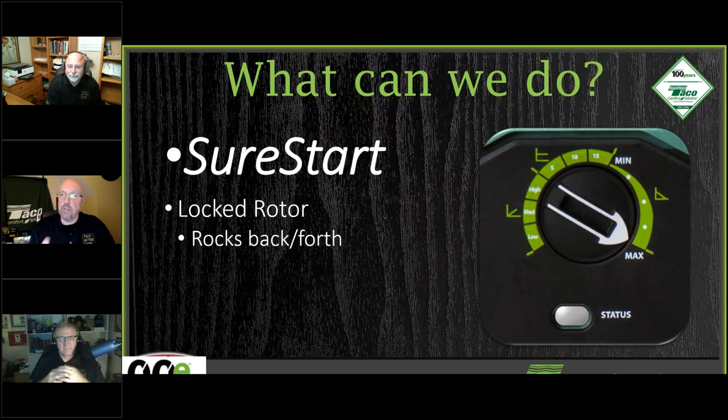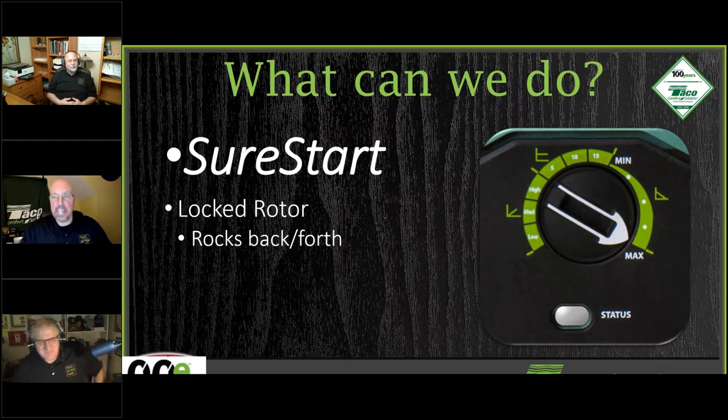What's the next thing you do, people? It's not in the instructions, but I know what you do and I want you to do it. If you know you've got a seized circulator not pumping water and calling for heat, what's the one thing I want you to do? That's right, Brian. You whack it. Whatever tool you have in your hand, a flashlight, a screwdriver, a wrench, channel locks, you give it a couple of hits to get it going. A rubber mallet, you're being nice, Ted. How many guys are walking downstairs in the basement with a rubber mallet?